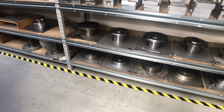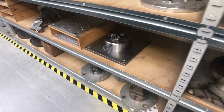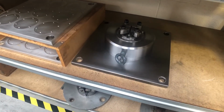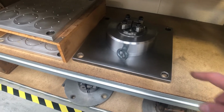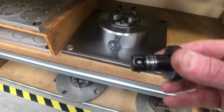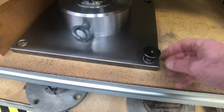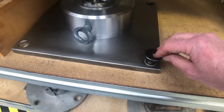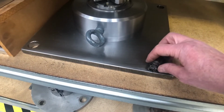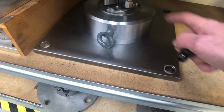Right, I'd just like to show you these fixtures. As you can see, they're all on these base plates, and they're 400mm square, and they have 4 holes in each corner. And we use what we call a ball lock that you can go through the corner. It goes right through into a base plate. You tighten this 6mm grub screw, which tightens down on some ball bearings in the centre and pushes these ball bearings out, and it puts a 3-ton pressure on each corner of the plate.